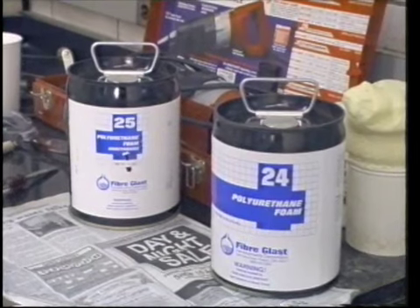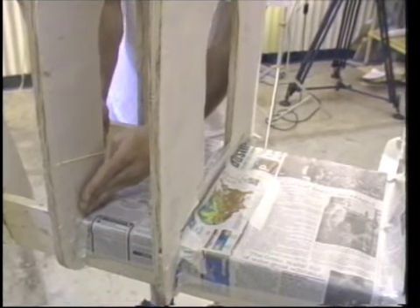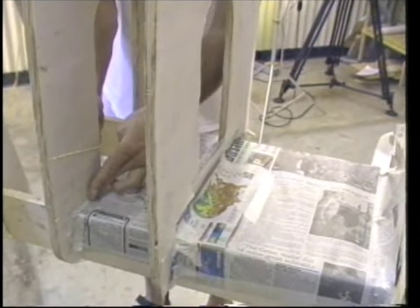Filling the plug with expanding polyurethane foam is ideal. Once cured, it is easily cut and carved. It is relatively inexpensive and will expand to fill even oddly shaped cavities. To save on foam, we didn't fill the entire plug, just the surface perimeter.